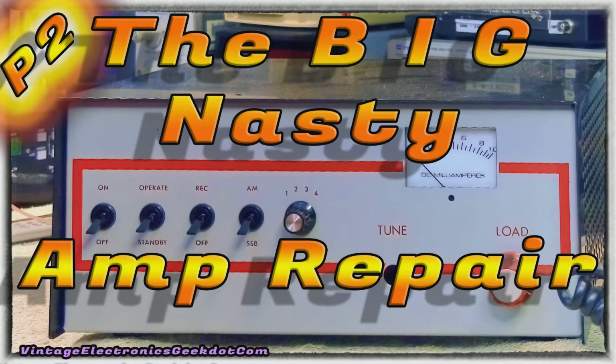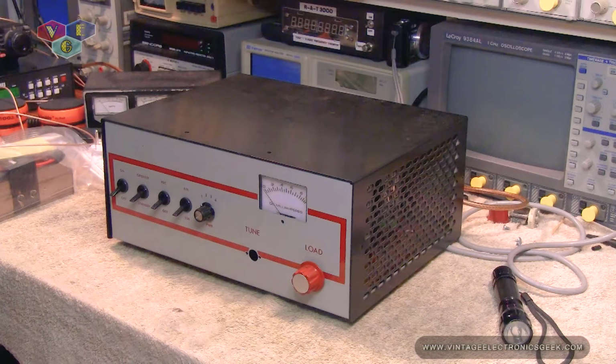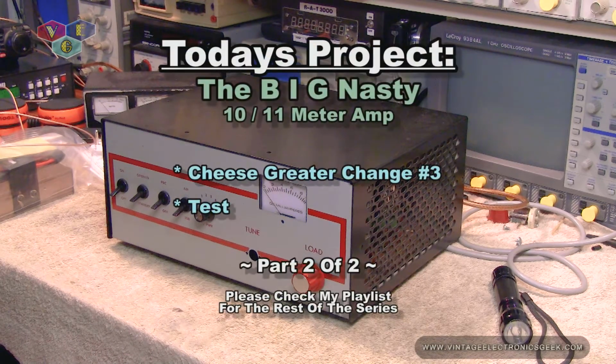Okay, it's been some time since we shot the last scene. I went ahead and soldered in another low-value capacitor, and I ran the thing until I think I messed that capacitor up. I think I definitely have proven Bob's theory that, yes, this does require a low-value capacitor.